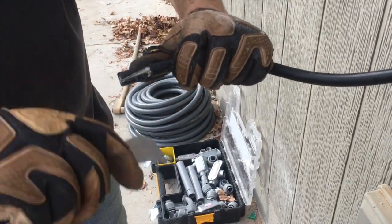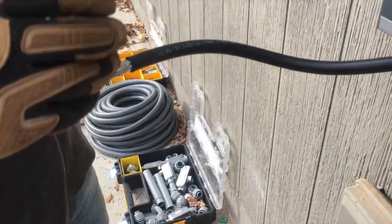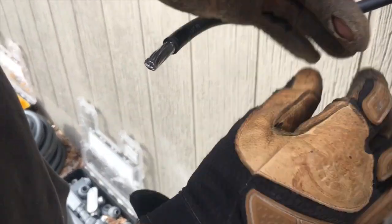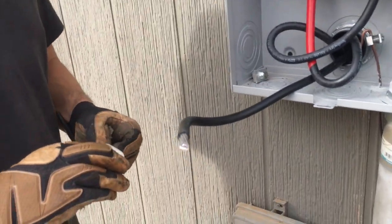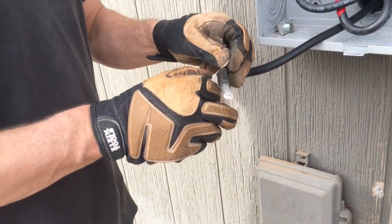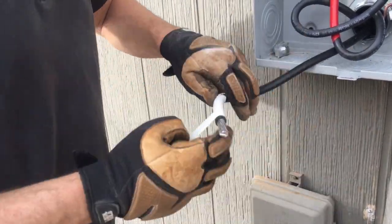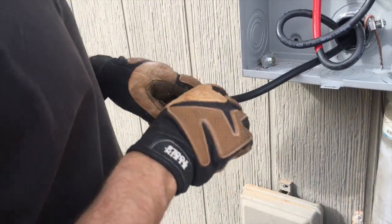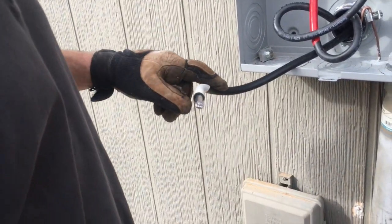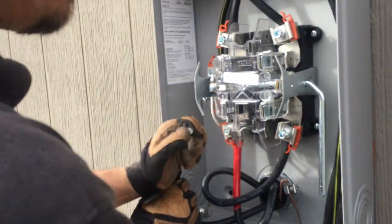Take your carpet knife and peel it just the way you did before. My gloves are on — I do have a hole in my glove, which is never good. This is dead right here coming in because the power company was here today. Go ahead and take your neutral tape. Code does state you should try to at least have that 2/0 wire showing its identification of your conductors, which is probably Article 400. It talks about the company, the date, the amp, the size of the wire, and the voltage.